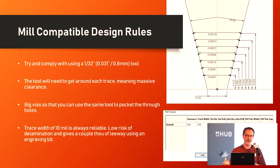If you have vias on your board, try to make them large enough so you can use that 1/32-inch tool to get through there. The problem is you do have to hand-solder those vias to connect the sides of the board — getting a piece of cut-off LED lead jammed in there and soldered on either side can be a pain, but those are the drawbacks you have to deal with.